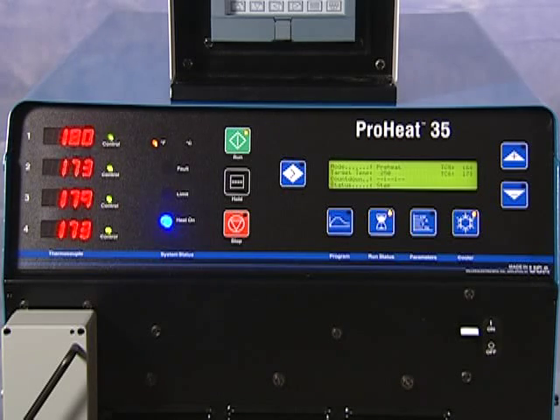This is a demonstration of a Preheat program as it is running. The system controls on the hottest thermocouple going up and the coldest thermocouple going down. It will not go into soak until all thermocouples are within tolerance range.